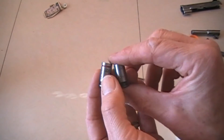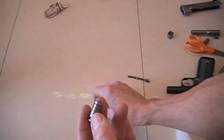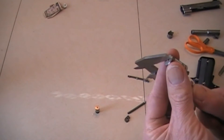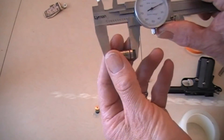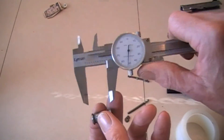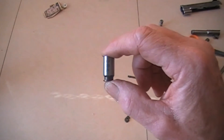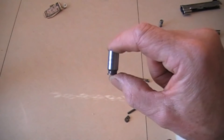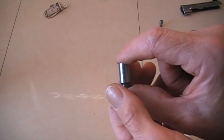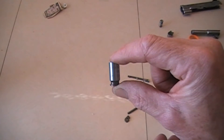This is a go and a no-go gauge that go into your chamber. The no-go gauge is at .919 in length. If the no-go gauge goes in your chamber, it's way too big. The go gauge is at .898 — that's the maximum length of a SAAMI spec cartridge. So by my books, this is supposed to fit into the gun and the slide should close on it.